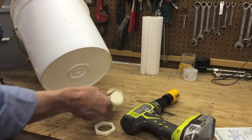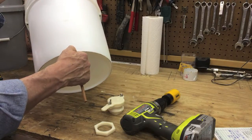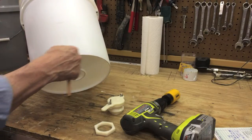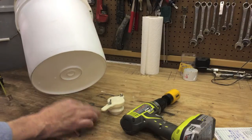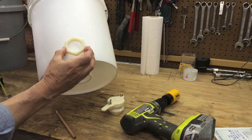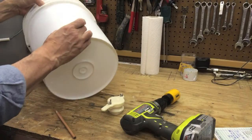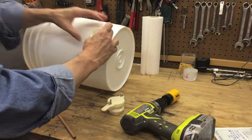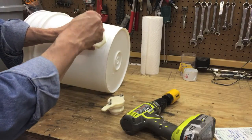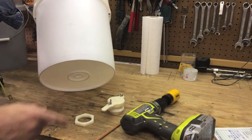The first thing I want to do is put the honey gate on the bucket — this is going to be our collection bucket. The bottom of the bucket is right there, so I'm going to mark with a pencil where the inside bottom is, move that up just a little bit, get a pencil line on there. I want to make sure that the most extended point of the nut on the inside is going to reach that bottom. I've got everything measured, and now I'm going to drill the hole.